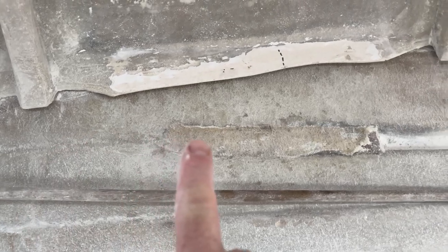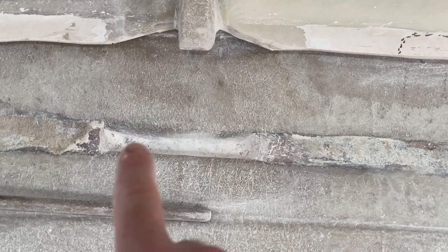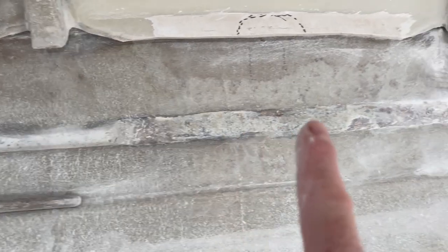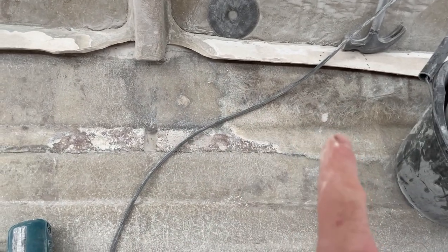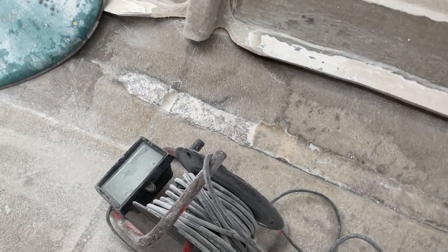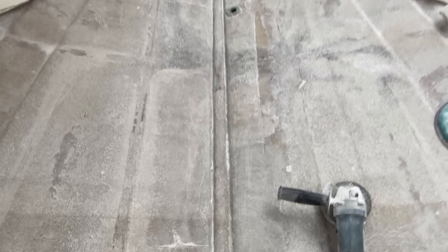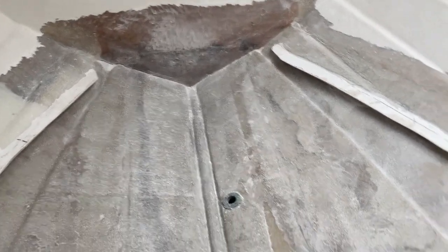When I swept up — that's the inside of the bilge keel — it's got like a really hard resin-y foam in it. I don't know what it is; there's a couple of bits that came out but where the glass went all around it, that's all lifting a bit. So I've ground the lot away, leaving a little bit of glass on top of the foam — I don't really want to disturb that because I don't know what it is but it's hard. So I'll glass over the bilge and the same on that side. That part was nice and hard and firm but this bit was all crappy so I ground all that out too. I don't know what it is — I feel like it's some sort of hard resin, but if you poured that much resin at once surely that would heat up so much and cause a few issues, unless they poured a little bit out at a time.